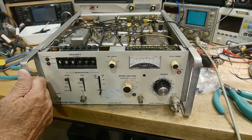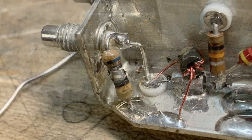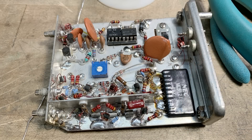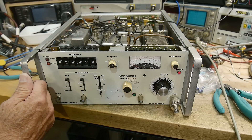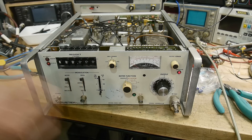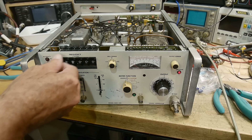Working on this again, I found a burnt-out resistor — it was a 68-ohm resistor loading the input into an amplifier. I replaced that, but it didn't help. Remember, we had a nice sine wave above 300 MHz, but below 300 MHz it was all square and really ugly looking.